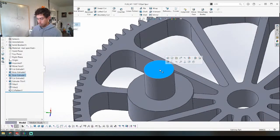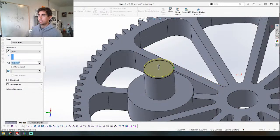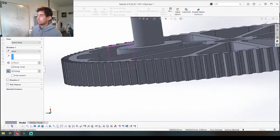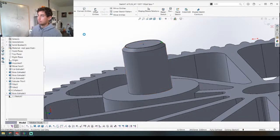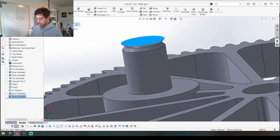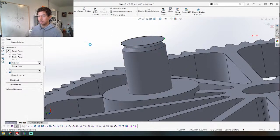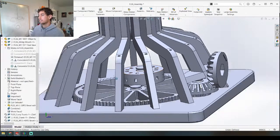Okay, so we'll do it again on this — because I have to do it here anyways. Sketch, convert that entity to a circle, extrude, the draft — it always drafts inward automatically. Do that top, and then here's the opposite draft: you just hit this right here 'draft outward,' and that gives you the opposite draft. Because it's drafting outward at the same height and the same angle it ends up being perfectly aligned, no problem. So there it is — done.